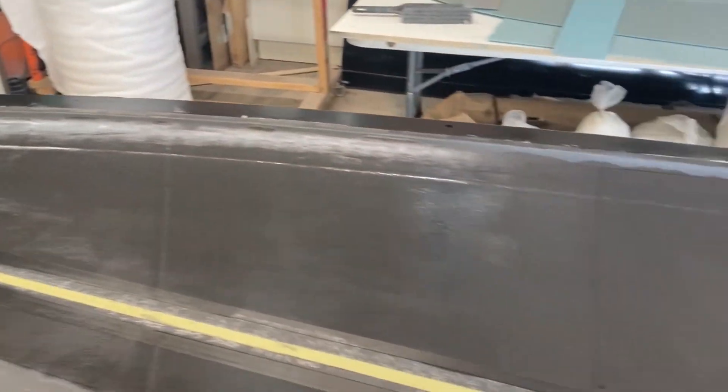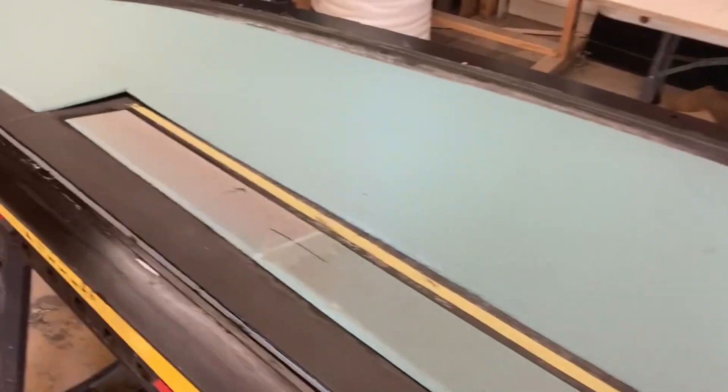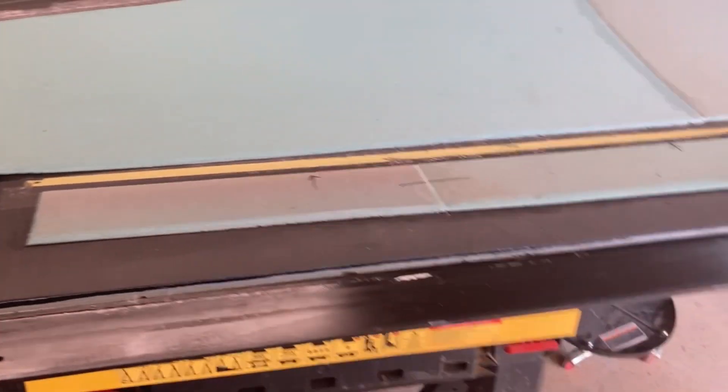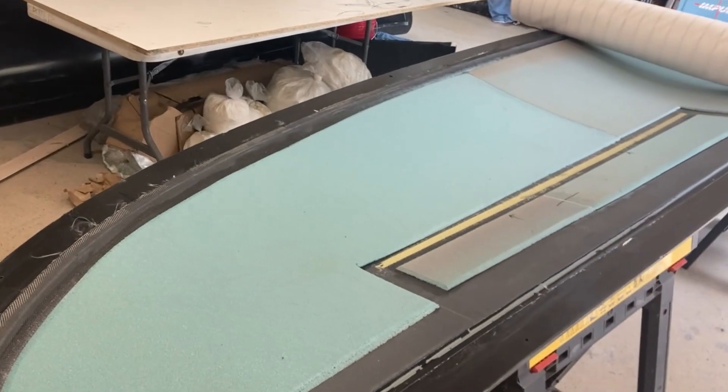All the core is beveled and I've marked out where the core is going in the mold, then rolled in a layer of neat resin. I'm going to make up a mixture of 50-50 micro and resin, put that on the back of the foam, and squish it in and bag it down. The 50-50 resin and micro is on the back side of the cores, they're all glued in with a little bit thicker where the seams are. Now we're going to roll out peel ply over the whole thing to keep the batting from sticking to the core — there's a little extra resin around the outside, so we don't want the bag and batting to stick to that.